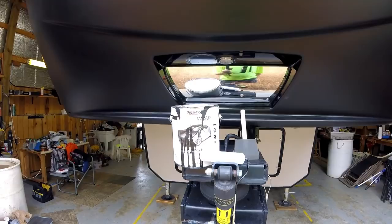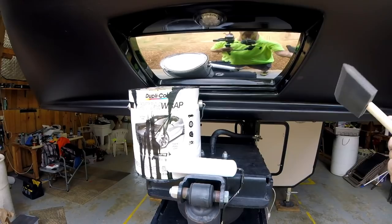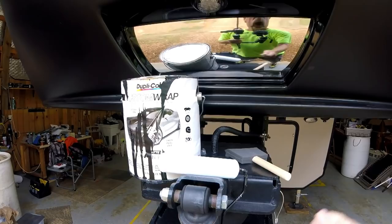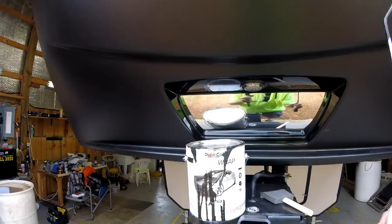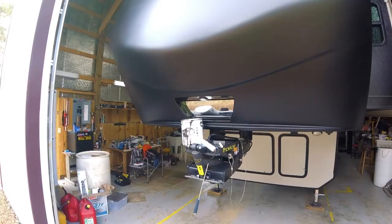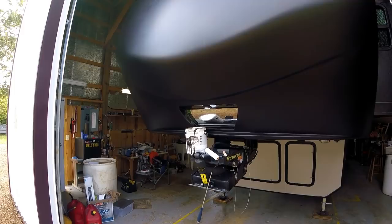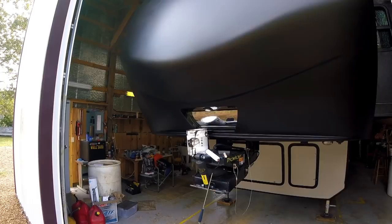Instead of spraying it on, because I don't have a spray gun, we tried something different. We rolled it on with one of these foam rollers. First we cut it in around the edges with a foam brush — just dipped it in and painted it on — and then we rolled it on the finish. There is a problem with doing that though: you have to let it dry really well between coats. When you go to put on the second, third, or fourth coat, you can't go over where you got it wet. Once you've put it on, you can't pull the roller back down — if you do, it'll melt the underneath layers and peel it right off. We had that happen in a few places, but eventually got the hang of it.